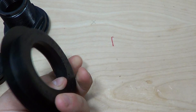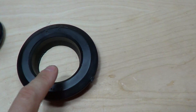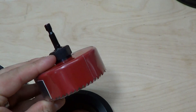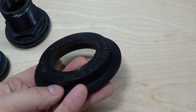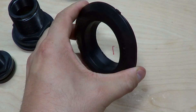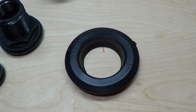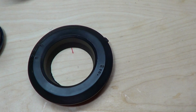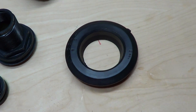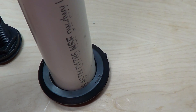It's basically one solid piece of plastic. You drill a hole larger than the Uniseal itself — this is like a three-inch drill bit. Then you have to lube it up with some soap water, and then you stick it into the hole in your curved surface, such as a barrel, and then you're basically good to go. You can shove your pipe directly into it. So like here's a two-inch pipe, and that would go into this two-inch Uniseal.